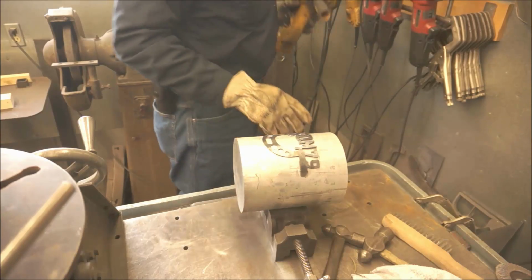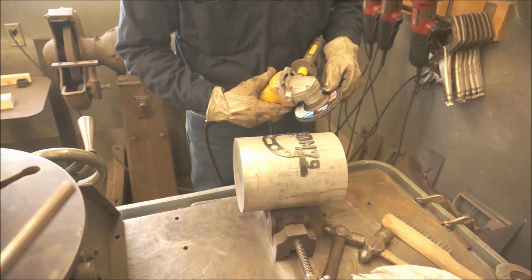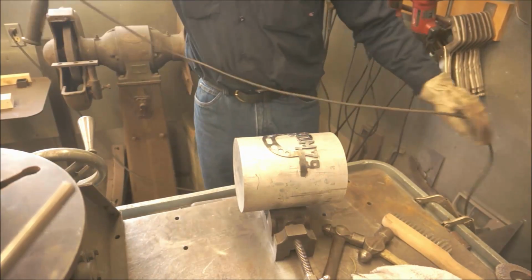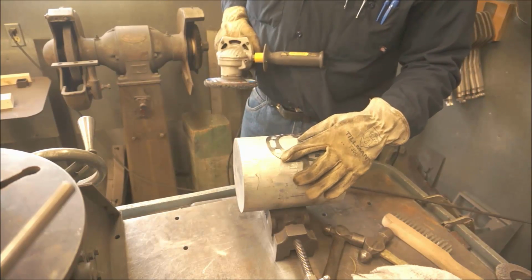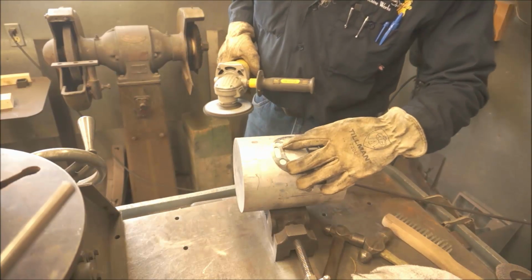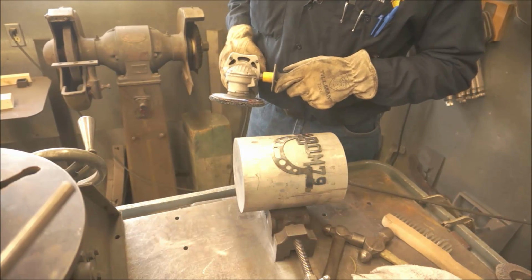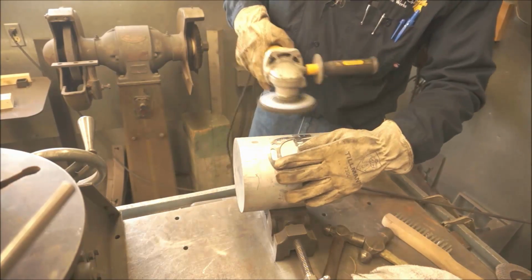But when I just want to go ahead and kind of clear off the black finish, I like these Norton Rapid strips here, and this is one of the black ones, and it's kind of like just a giant Scotch-Brite pad. It's really kind of what it's like, and it does a pretty good job without really putting a lot of hard scratches into the part. And you know, a couple areas where the vice grips actually gives kind of a little bit of dimples there, I can massage that out with a little bit more pressure.